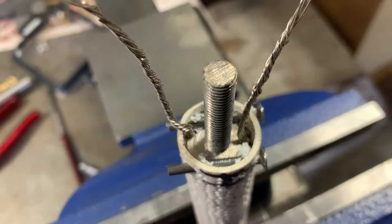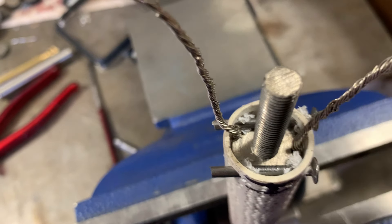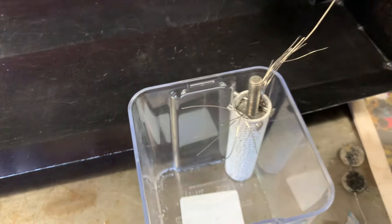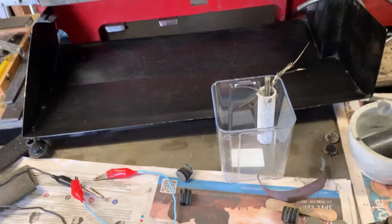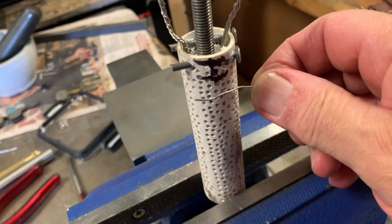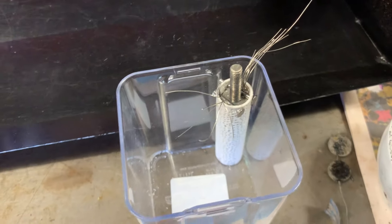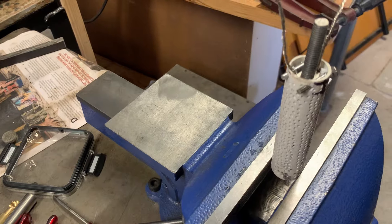I got 10 wires on that side and 10 wires on this side. I made two grooves because the diameter of the wires starts to get large. So that's both of them done. The nickel side has got 14 layers — I should have used the pin idea earlier. According to documentation for nickel-iron batteries, the negative iron side has to be larger than the positive anyway. So it might be good having 20 layers there and only 14 on the nickel side. I've got 0.7 grams of Fe3O4 per layer instead of the 0.5 grams used in the other cell.